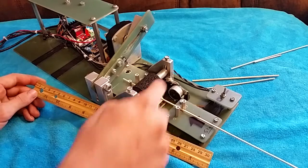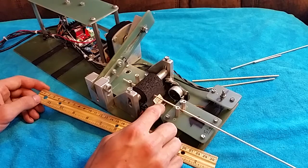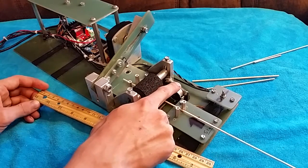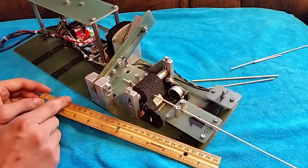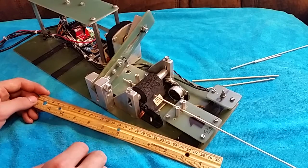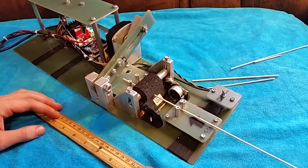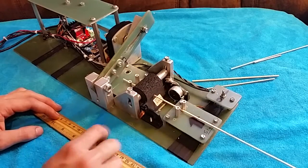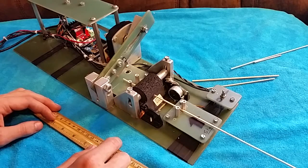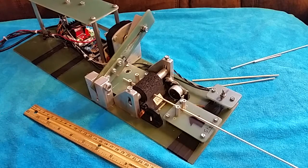Let's measure one — five centimeters. It's really, really accurate — about half a millimeter off, and that's probably my fault from inputting the calculations for steps per centimeter. I did a really long piece on my ruler, about 30 centimeters, then divided by the number of steps to get there. It takes 153.83 steps to go one centimeter, and I think that decimal value is what makes it off by that much.